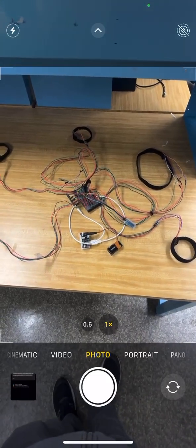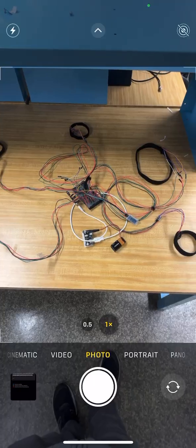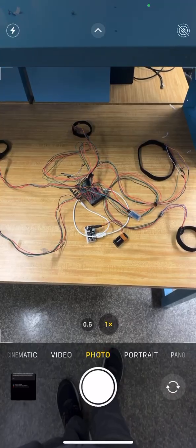This video demonstrates a proof of concept of a motion tracking device using deep learning. It uses 6 MPU 6050s, one on the head, 2 on the elbows, 1 on the waist, and 2 on the knees, to classify movements into 5 different categories, specifically going downstairs, sitting, standing, going upstairs, and walking.